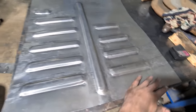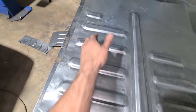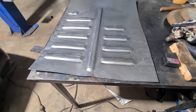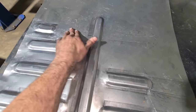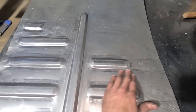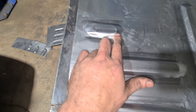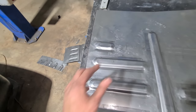I've started bashing down all the waves. I've got to mark in 90 mil, do all the slits, turn that up, fold this flange down, and then just treat all these little areas that are rising up — they need to be stretched here and there. Having a shocker on this one — I don't know why I made it so short but it's got to be 145 mil here. I've got to fix that now and fold the edge up.